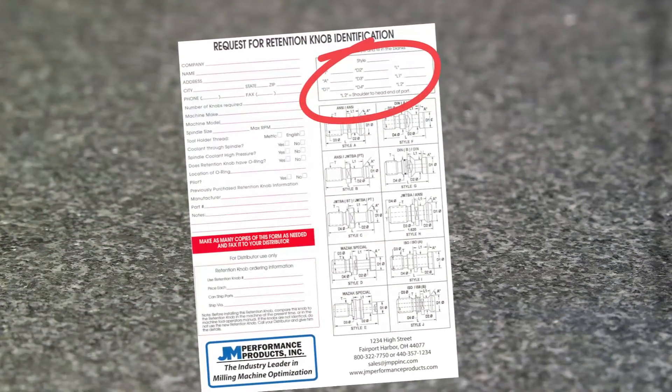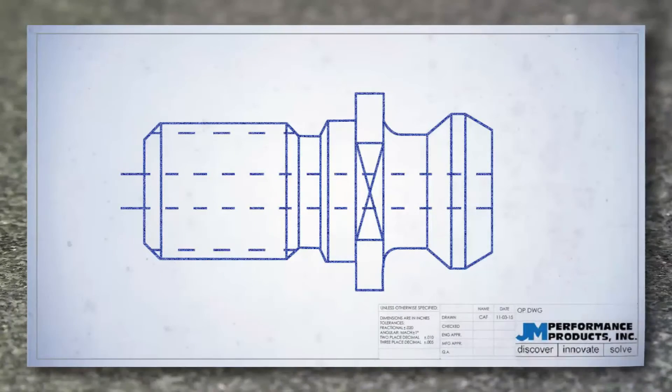Last are some key dimensions that need to be verified. The first is the measurement from the bottom of the flange to the bottom of the knob head. Next is the measurement from the bottom of the flange to the top of the knob head. Determine the dimension of the head. Another key dimension is the neck diameter. Verify the flange thickness. If the knob has a hole, verify the size of the coolant hole if necessary. In some cases, to accommodate a coolant plunger, your machine may require a special hole. Finally, verify the angle of the knob head to the neck.